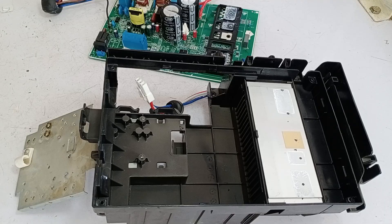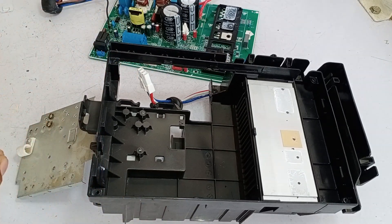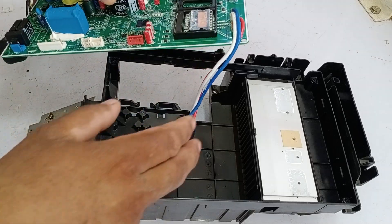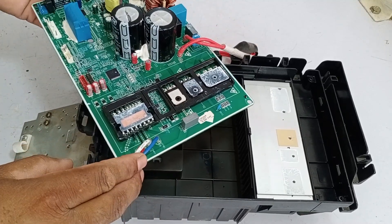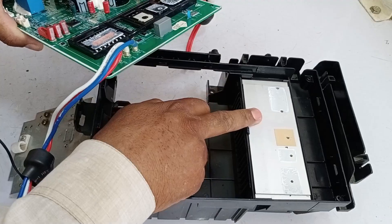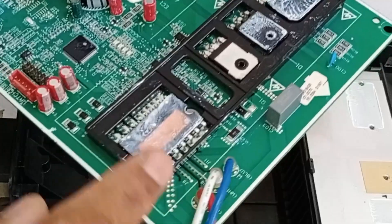Let me tell you what mistake caused the circuit board to fail while running inside the unit after I had repaired it. I analyzed it and discussed it with my son, who also worked on it — he handled this part of the job. The mistake was right here: I repaired it and then told my son to install it on its heat sink. He tightened the screws of the three components on the heat sink, but the screws on the IPM were left loose.